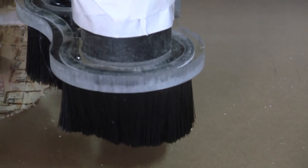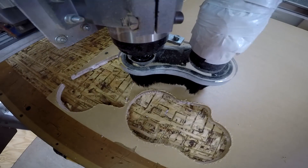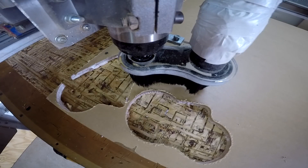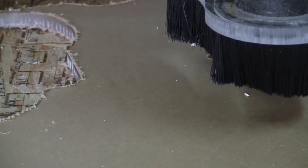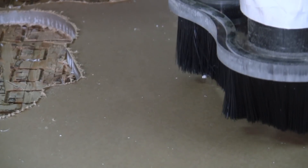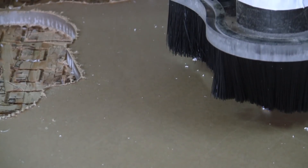We verify that through the visual portion of Mach 3 — you can actually visualize where the file is going to be cut within the X and Y position. With that verified, we start cutting. Here we are doing two — I believe 3/8-inch diameter holes for the screws to secure the L-bracket to the machine and attach it to the plexiglass.